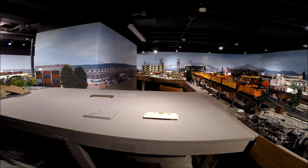The first one that I happened to pick up from the bin had no play, and I'm thinking, oh, this is great. It has like a plastic sleeve bearing surface in between the components of the hinge. The second one that I picked up, because I wanted to do two hinges on this section, had play in it. I said, well, I can't have that. So I picked up the third one, it had play, and the fourth one had play. So I ended up going through the entire bin at Home Depot, and on the 45th hinge, I found a second one that had no play. So basically two hinges out of 47 hinges had no play, which is what I installed on this section of the layout here.